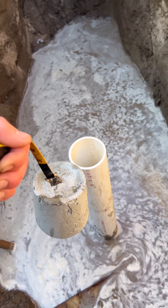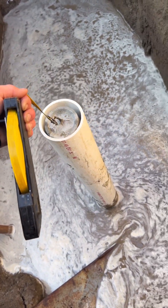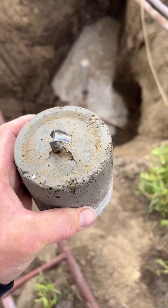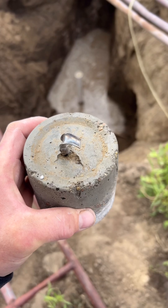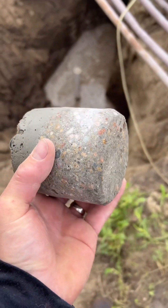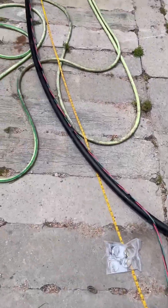I dumped some pea gravel down there to make sure I'm at 40 feet, and this plug is going to go in nice and gently. Don't do what I did — it was too tight. I lowered it down with the tape measure, got to 30 feet, and it sat right on top of the screen and got wedged. I had to fish it out — nerve-wracking. I ground the taper off so it's got a lot more slop. If anything can go wrong, it'll go wrong for me.